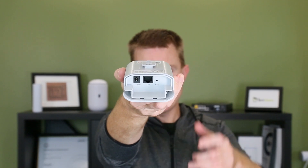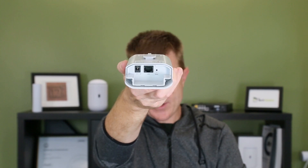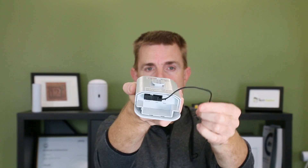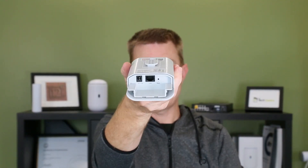Removing the base, you can see inside. This is 24-volt PoE powered, so you can see the ethernet port. There's also a reset button on the side, and another connector — this is a 12-volt input, so you can connect this directly to solar or a battery. Even better, you can actually have both the 24-volt PoE and the 12-volt plugged in at the same time. It will run in active standby and switch power if there's a failure on one of them.